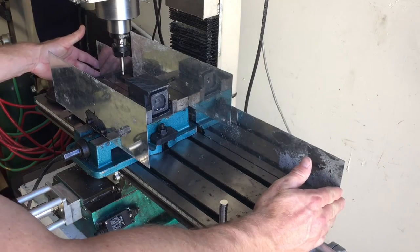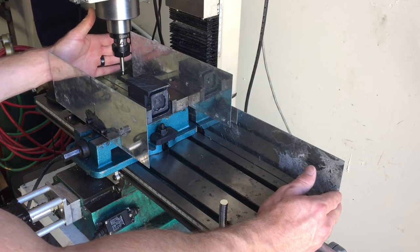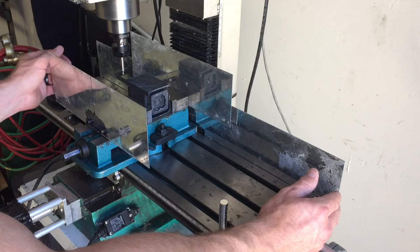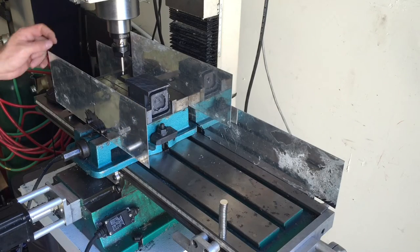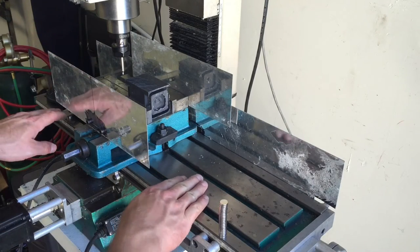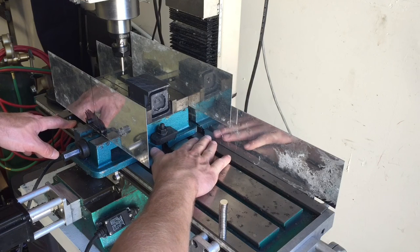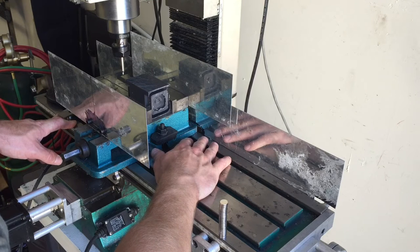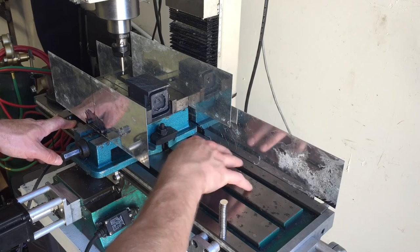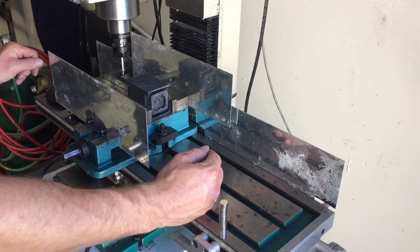What do you think of the overlap here? I think it's pretty good. We've got this plate in front of this one, so everything that hits it will go down. I think that will help catch a bunch of chips. We can do one for each side, and if we want to, we can add something on the sides too. I'm leaving this open for now. Another thing I was thinking was putting down some wood or aluminum on the table itself to keep chips from filling up in the slots — nice for cleanup, just vacuum really quick.